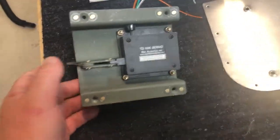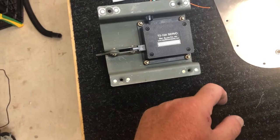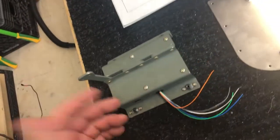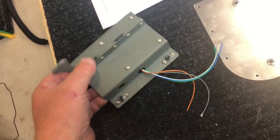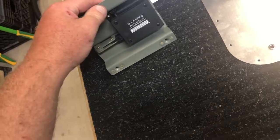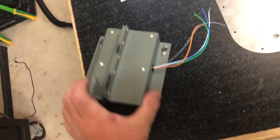The big thing I would just say here is take your time. I made one mistake — I had to drill out all these rivets because I didn't dimple this hole. I just wasn't paying attention and it's not in the instructions anymore. By this point in the build, you should know what you're doing. I was watching the PGA Championship and got distracted. But basically there's nothing difficult to do here — you cut out the parts, you sand them down on your bench grinder, you torque down your screws, you rivet this together. That's about it.